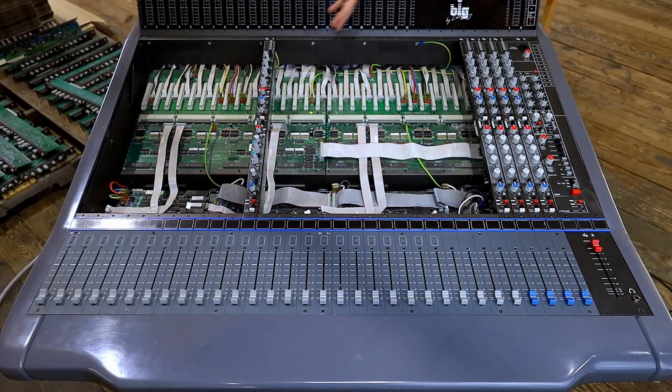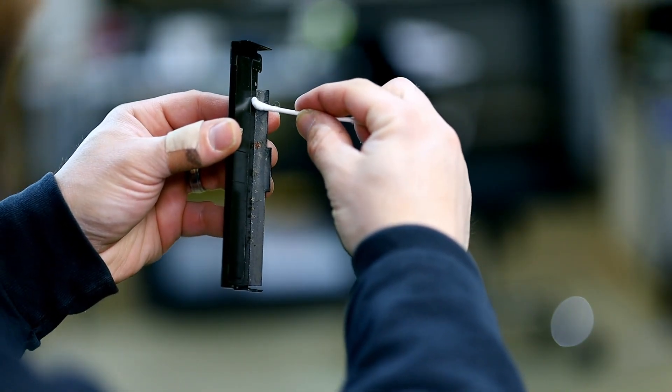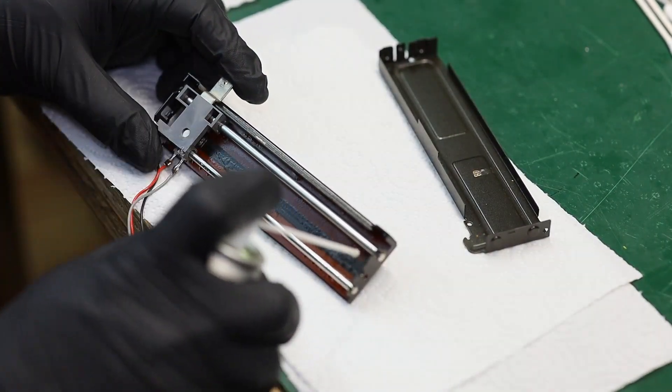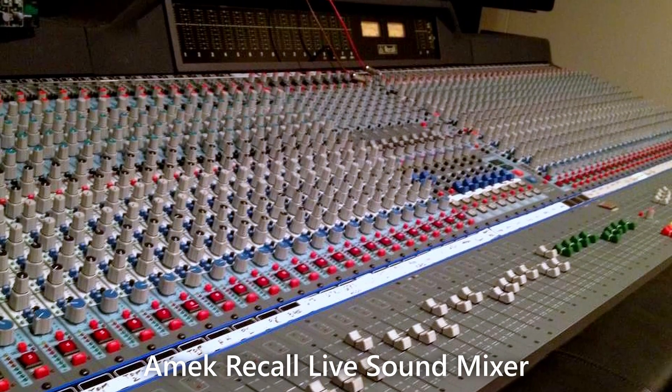I was able to get the end panels on and the front panel that I made for my original Big 28 — all that stuff's mounted on here. I'm working on rebuilding the fader banks: taking the faders out, cleaning them, lubricating them, putting them back together, hooking them back up to the fader banks, and then rewiring the whole thing. These are new fader banks — not necessarily new, these were from a recall, same brand and same era. The stereo master is also currently rebuilt.